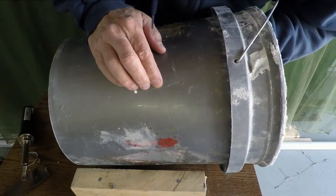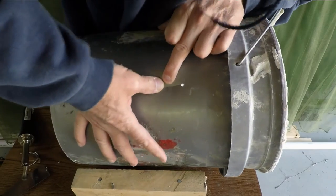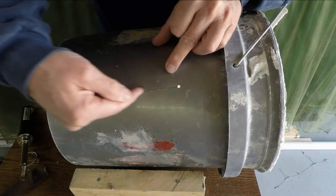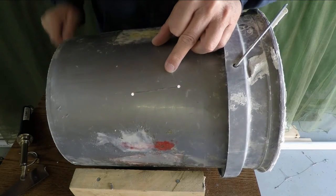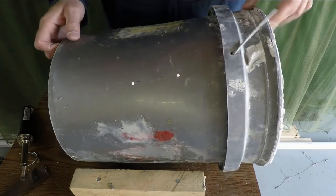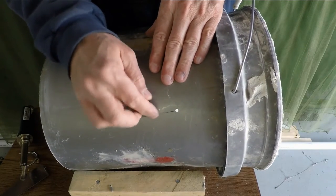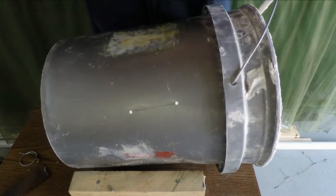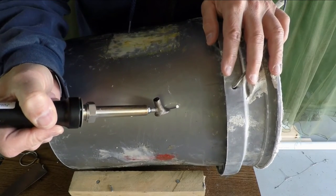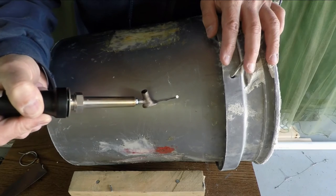The one thing I can't do is just put the material right over the top of this, because that will not fill in the crack. What I've got to do is actually dig out some of the HDPE by cutting a V-groove using my KC Welder. Then I can take the new material and put it in on top and fill it in. You also need to do the same thing on the inside, because the crack in this case goes all the way through. So I've got my welder here, and now I'm just going to run it down and cut out a V, so I've got room for the new HDPE to be put in.